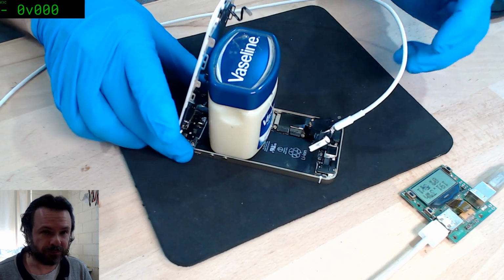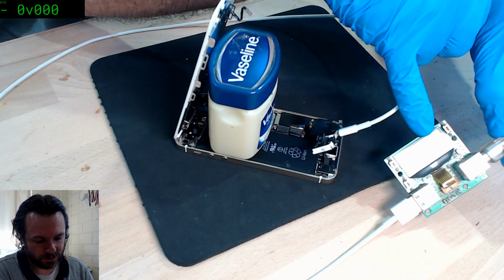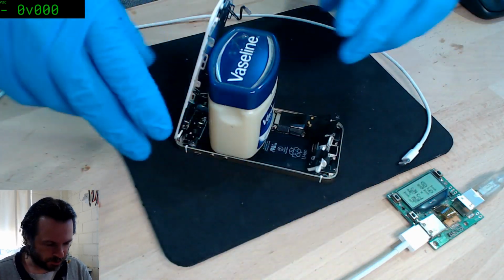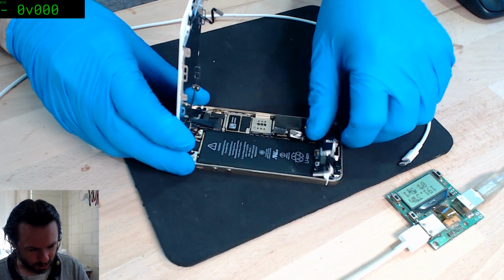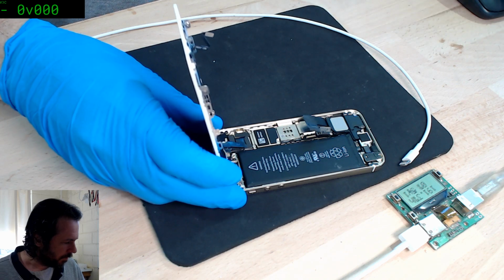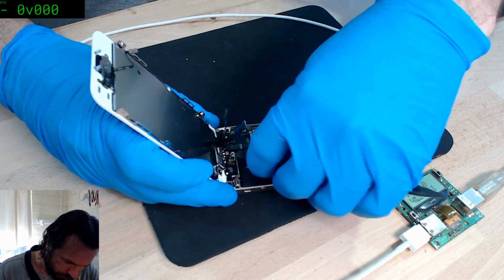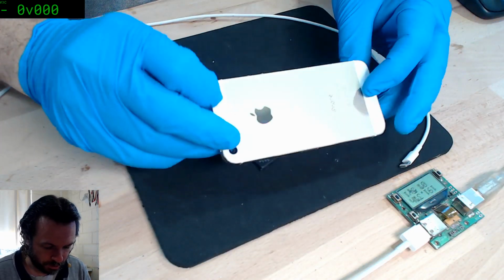Alright, so we're plugged in, but even though it's upside down, we've got 0 milliamp charge. So it's a pretty good chance that's a Tristar. I just had to eliminate that because it would be really, really dumb of me to do a Tristar replacement and then find out that it was actually the flex. It'd be amusing for all those watching me do it, but I'd be angry at the end, because other than that, this phone's in very good condition.